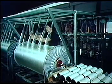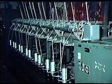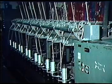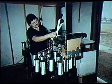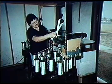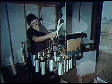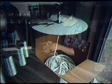Sky Genie uses only the highest quality nylon possible to manufacture the safest line. Each of the beams contain thin nylon strands, which are called ends. Each rotating bobbin winds 33 ends, one more than other nylon lines. They're given a 3/4 twist during the winding. That's so the twist of these 18 bobbins on the braider will actually strengthen the ends again. That gives the 600-foot finished line more tensile strength because there are no splices. This nylon line is heat resistant up to nearly 500 degrees.